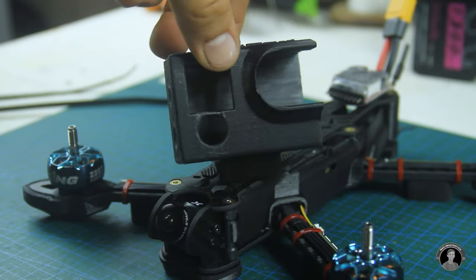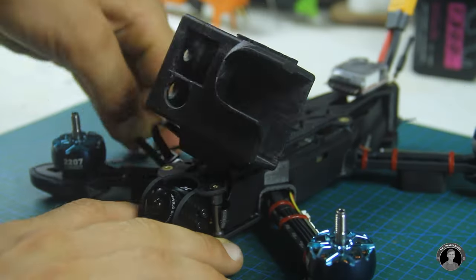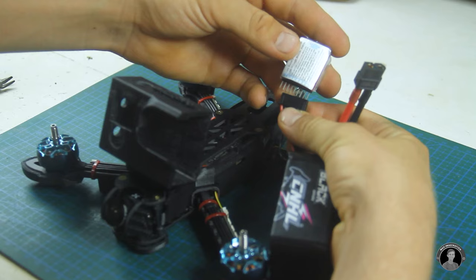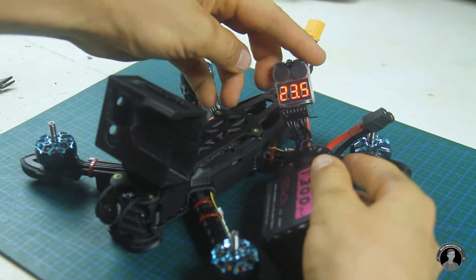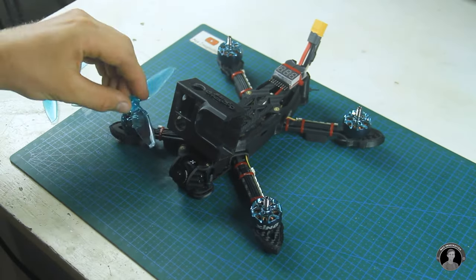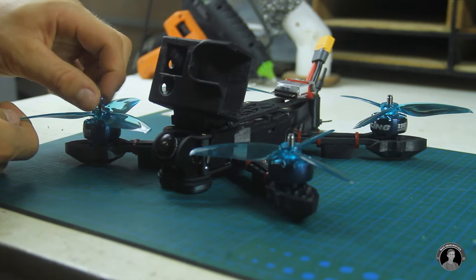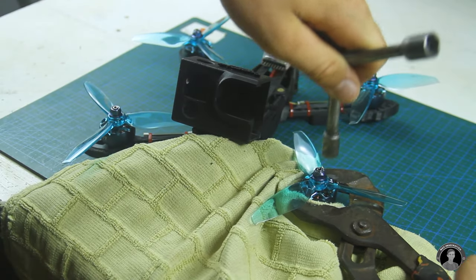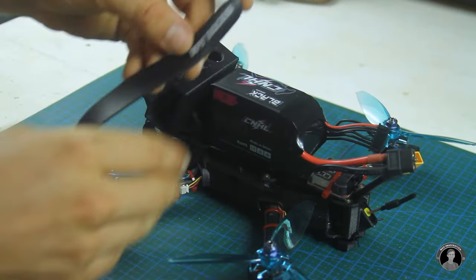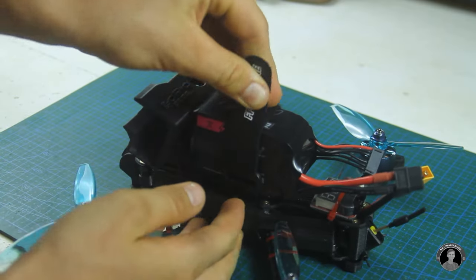This is another one of the parts I had printed — a low profile mount to hold my old GoPro Hero 4 action camera, secured simply with a couple of zip ties. The balance charger kit also came with this battery meter alarm module, which I find super handy, so I'll also secure it to the drone. I got this pack of Gemfan propellers in a transparent light blue to match the motors, secured with a self-locking nut on each one. Securing the 6S LiPo battery on with a velcro strap, the drone's now ready for flight.